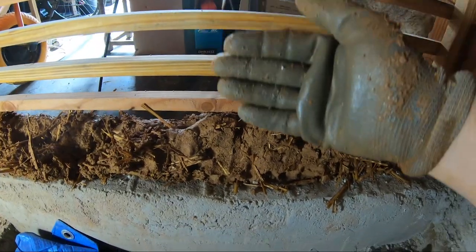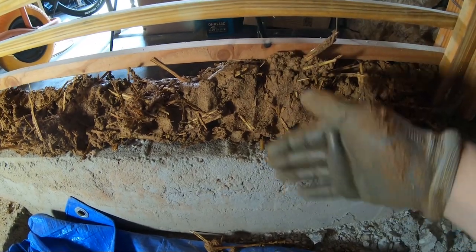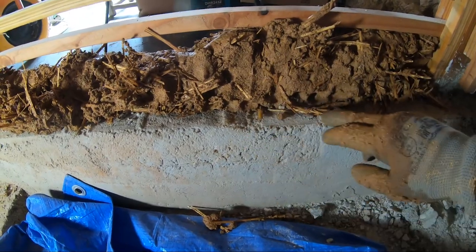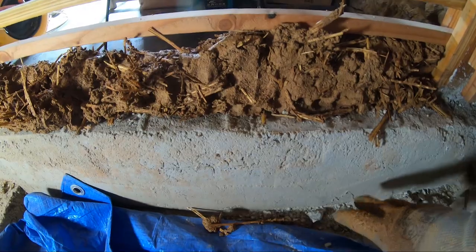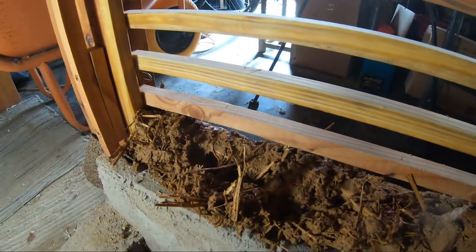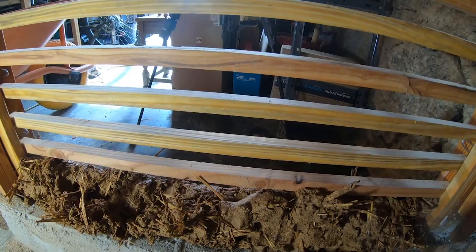And then the lime needs to come so that it kind of overhangs this shower tray, which will eventually be tiled, but it has to overhang a bit so that no water wants to sit on any lips or anything like that. So it'll shed away, go down the drain, and be gone. So that's what I'm doing. I'm just going to keep building up from this side, and then once I get a bit higher, I'll go to the other side and smooth it all out.